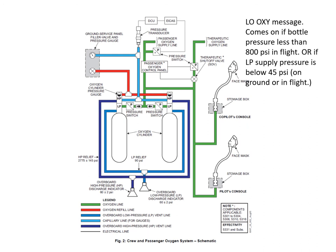You need to look at your supplementary manuals for the passenger side of things. Broadly speaking, the Bombardier factory takes the supply up to the cabin bulkhead, and from there it's the completion center. We have in the cockpit a passenger oxygen control panel which will automatically deploy the masks if the cabin altitude reaches approximately 14,000 feet — though it can vary depending on whether the aircraft has a high altitude landing mod. At 14,000 feet the masks drop; there's a pressure switch in the supply line that will indicate the passenger oxygen system is activated.